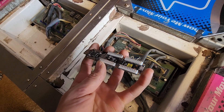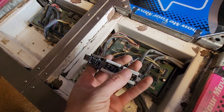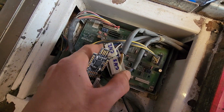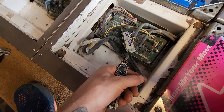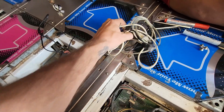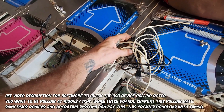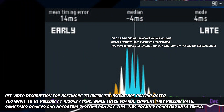These are powered by micro USB right on the end, so that's all you need. You plug each arrow onto one of these headers, and then a micro USB cable goes to your computer. You can use various USB extenders to get there. Make sure you don't have any old USB 1.1s — you don't want to unnecessarily slow anything down.